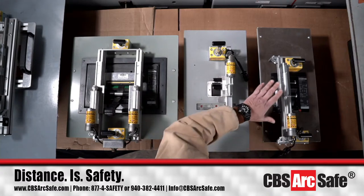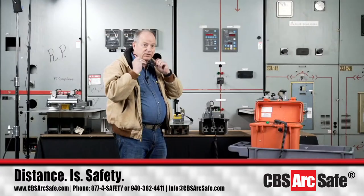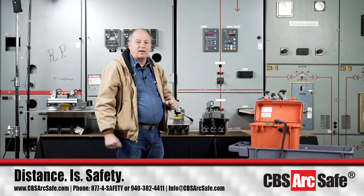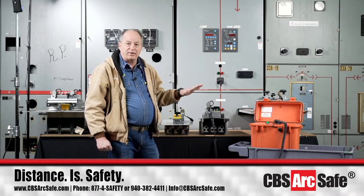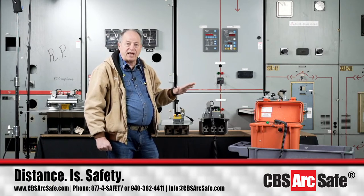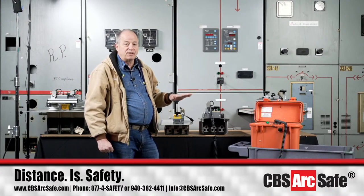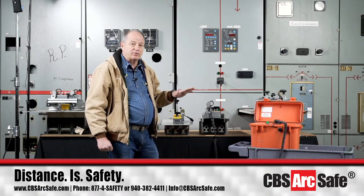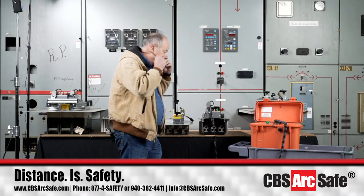Now, the thing to remember with these is this is showing a flush mount. And when you're dealing with a lot of the Square D type things, the way that they mount their stuff, they may have it recess mounted. So we need to see the pictures of how it's mounted in the panel board to make sure that we give you the right actuator for that. Sometimes they're flush mounted, other times they're recess mounted, and we need to know that geometry so we build the remote switch actuator for what your specific needs are.